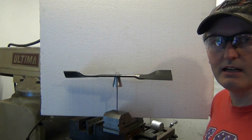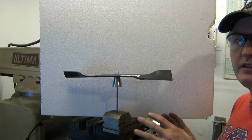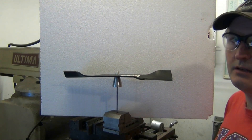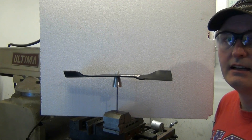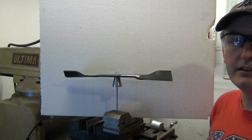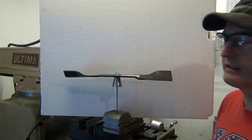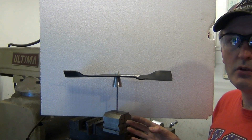This gives you a better background to see what this thing is doing. As you can see, this blade is pretty well balanced — there's a tiny little bit more weight on this end, but I'm not going to mess with it. You're never going to notice that. I mean, we're not balancing a jet engine compressor here — this is just a lawnmower blade. It has to be close, but not perfect. As you can see, this blade is ready to go on the lawnmower deck.